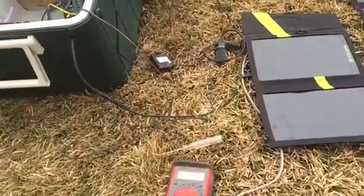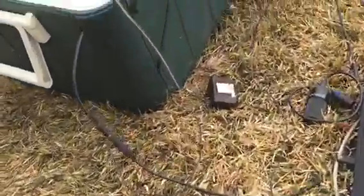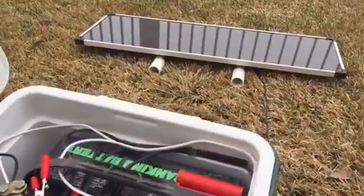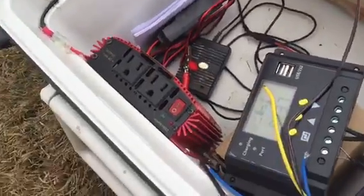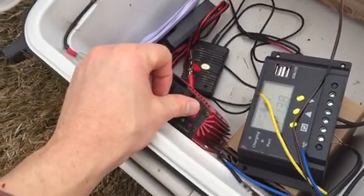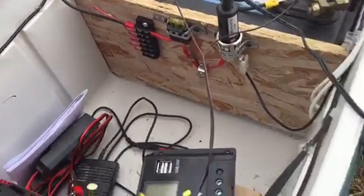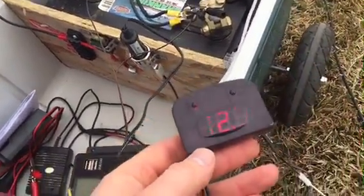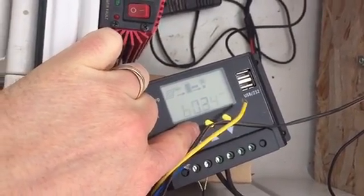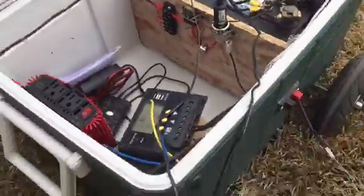I'm going to show you a little setup that I've been working on. I'm obsessed with alternate power but I'm not very good at it, so I'm just tinkering and trying different things. I set up this little thing with an 18-volt 18-watt solar panel — right now it's pushing 13.8 through it, just charges everything here. There's a noisy DC/AC converter and it's doing 12.3 right now. The battery is 12.4 and it shows I'm getting a signal off of that.